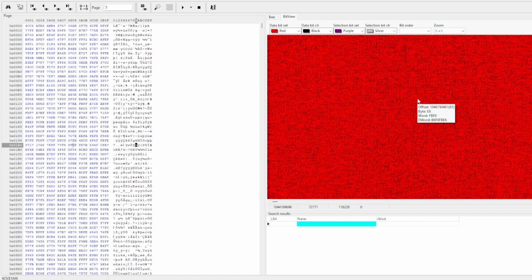It's very difficult. And this is the case with practically all NAND memory chips, whether they're on a USB stick or an SD card. Now, I've been going through this one, and it appears to me that it's using an even more complex exclusive OR pattern, known as dynamic exclusive OR. I like to pronounce exclusive OR as XOR, so it's just easier for me to say. So this XOR algorithm key changes each time there's a write to this memory card.